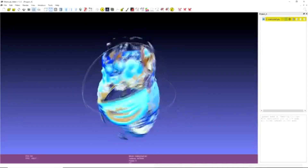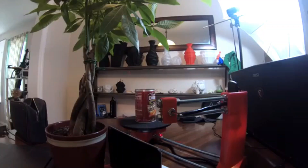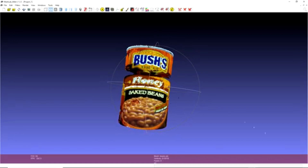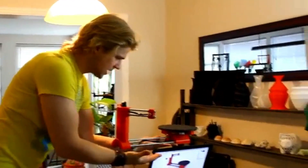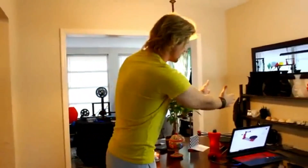There are a couple of factors to take seriously before scanning that affect quality more than we imagine. The first is the light — make sure there are no shadows on the platform. Another factor may be the surface sheen of the object; if the object is shiny or reflective, it will be difficult for the camera to properly scan because the laser will be reflected. This is a very practical scanner and one of the cheapest on the market. Because it's open source, hardware and software are always improved by both the company and contributors. I would recommend it to those who like to tinker with technology — if you are tech savvy, this scanner can be very inspiring.